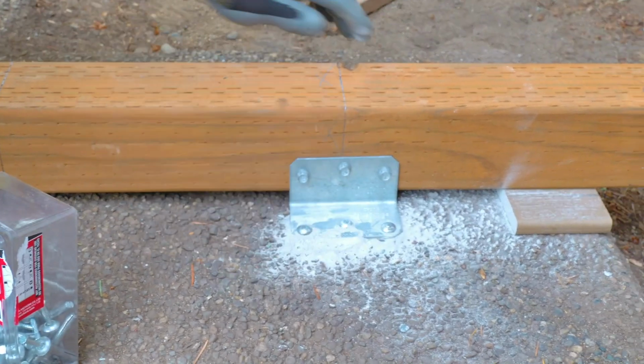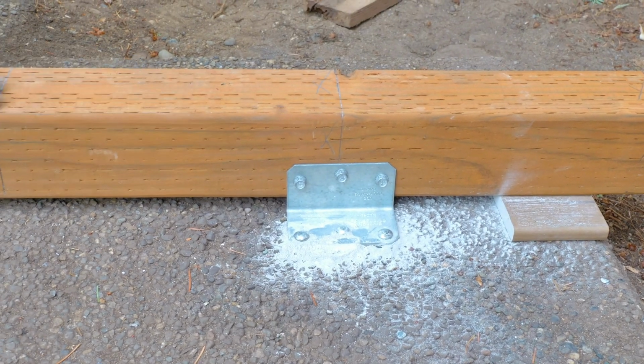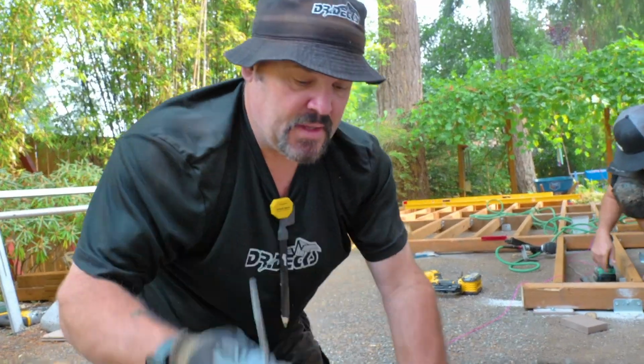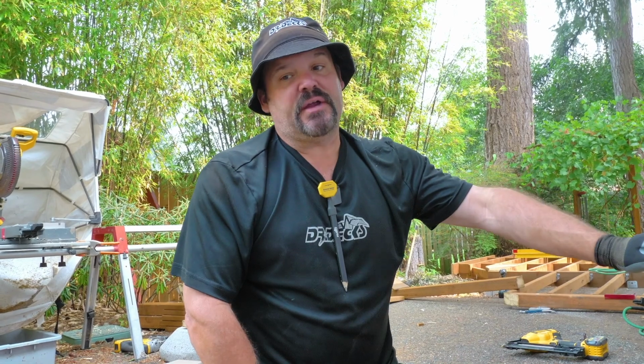And there's three going into the concrete on each side. Now the concrete's only 4 inches thick, but we're only using a 1.5 inch nail, and that's with a 1/4 inch bit like so. And what that does is that keeps the 4x4 from ever wanting to warp or crown on us. These are nice and straight right now because they're still wet from the factory.